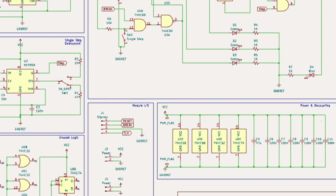And then I've got 3 power connectors, the intent being to put them on 4 corners of the board so I've got some stability. There's relatively few connectors on this particular module, so there's not a whole lot here that is going to actually support this board. So I'm going to go ahead and put extra connectors, and if I'm putting an extra connector, it may as well be power, because I've got voltage distribution problems already. So I may as well go ahead and make the best of that.